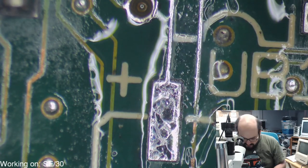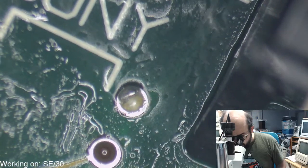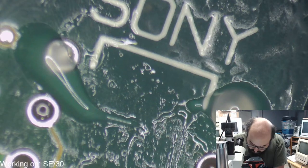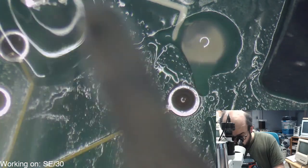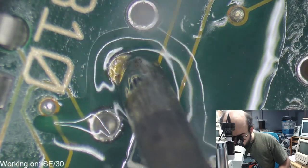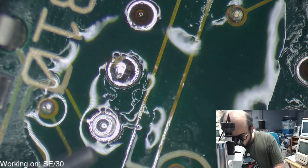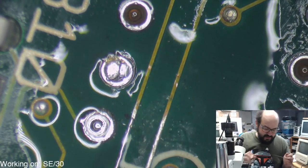Alright, cool. So we can put this chip back on. Just gonna get some of the solder off those pins to make that easier, because we don't want to melt this button that's right there. Okay, that's a little delicate. Sometimes it doesn't make sense. Why are you adding solder to something you want to remove solder from? But trust me, it helps.